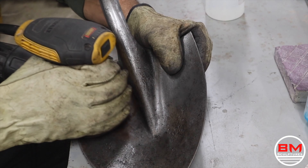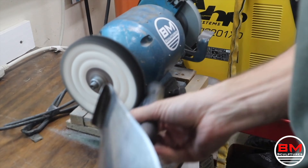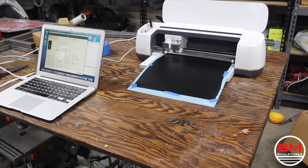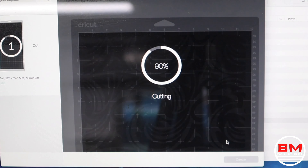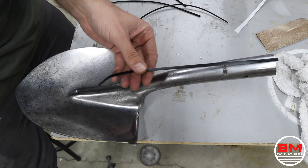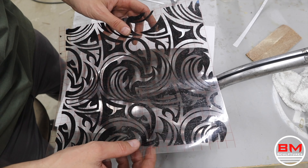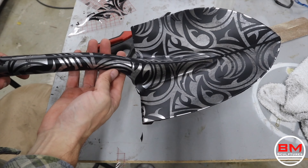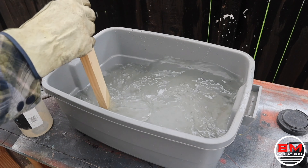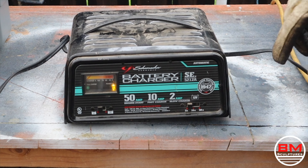I sanded from 100 grit up to 2000 grit, then polished on the buffing wheel to get the best shine. I used my Cricut Maker to cut out my design in vinyl and then attached that to both sides of the shovel. I wanted to match the oak pinstripe in the handle, so I cut a little vinyl slice the same diameter as that pinstripe and put it on the shovel first. Here it is all masked off with the vinyl and ready for metal etching. If you want to learn more about metal etching, I have an instructional video with two methods — I'll put a card up top and a link in the description.